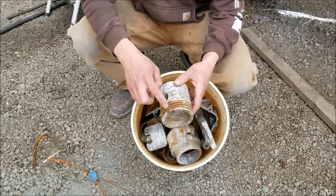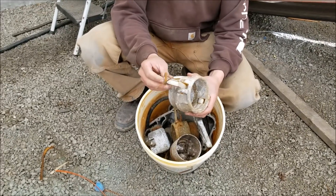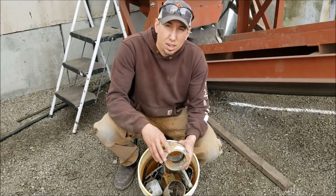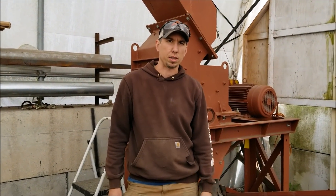It's all dirty though and it's got these steel rings in it, some of these quick lock releases. So the goal is going to be to break up the aluminum, liberate the steel, and pull it out with a magnet. Then all the non-ferrous is going to go out at the end and we'll catch that clean, and we'll have a ferrous fraction as well.